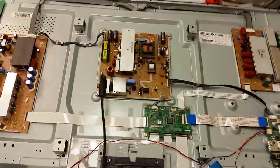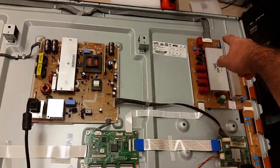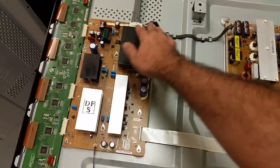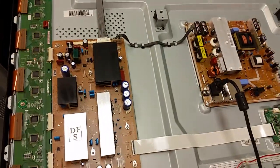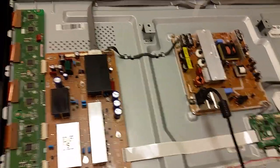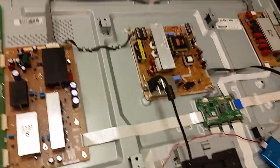I really quickly went through this whole disconnection thing. If the TV would continue to shut off when we disconnect the X mainboard, the next step would have been to disconnect that cable, and by doing that we would have disconnected of course both those two, but that's what I would have done just because it's easiest. And if the TV would come on, then the problem would be here on the Y mainboard. Not 100%. I can think of exceptions because they all work together, and especially not necessarily for other brands and other generations of TVs where feedback may go differently.